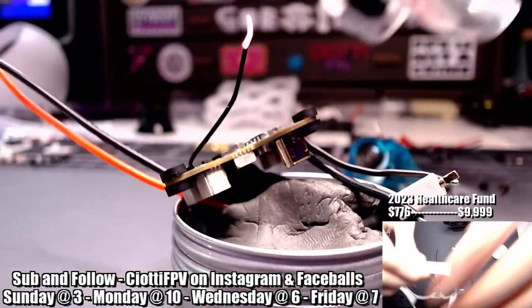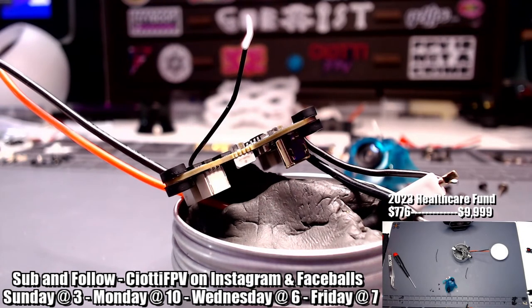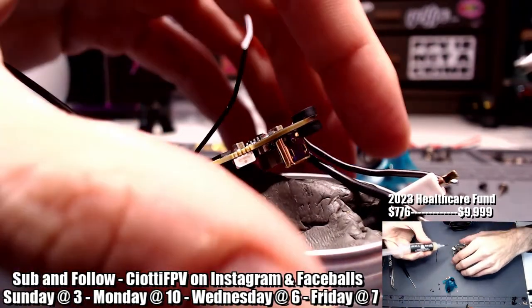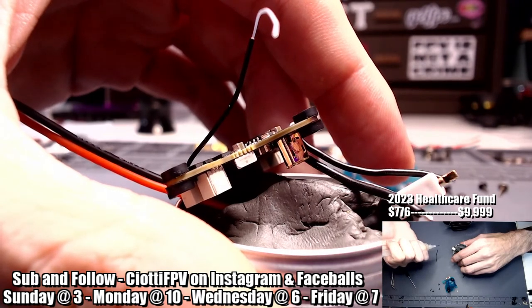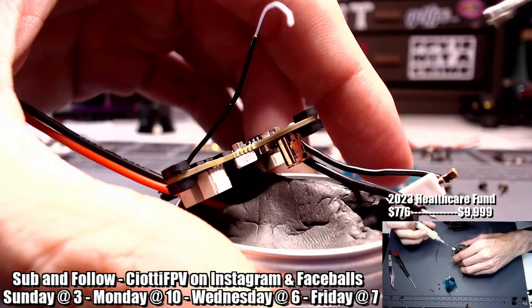And I got to put the nerd goggles on here because this is real small work. I'm going to flux the BT 2.0 lead instead of tinning it because I want to put as little heat into it as possible.